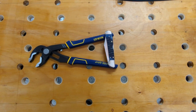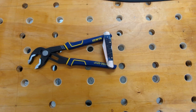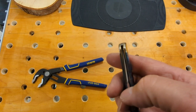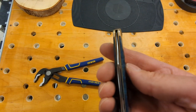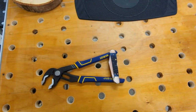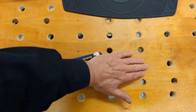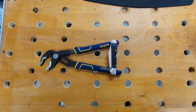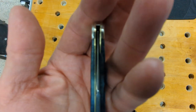The hammer I had sitting on the table wasn't a ball peen hammer — that was a standard hammer — but when you tighten that pin you want to use a ball peen hammer; it's got the right shape. On this larger of the two Copper Locks, even after tightening the pivot the blade was still rubbing hard against the liner. The frame almost looked like it had a slight bow to it, so I took a pair of pliers that was handy, laid the knife like this, then took my foot — just a stocking foot — put my toes down, put my heel against the knife, and pushed and rocked down on it about half a dozen times. I weigh about 220 pounds and put most of my weight on it as I rocked — and that's what it took to straighten it out. After doing that, the blade is very nicely centered.